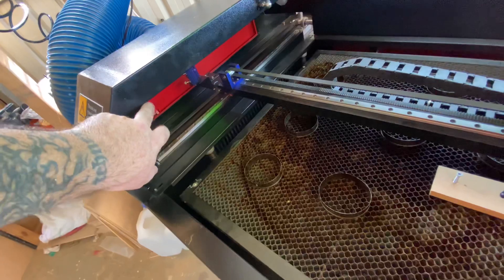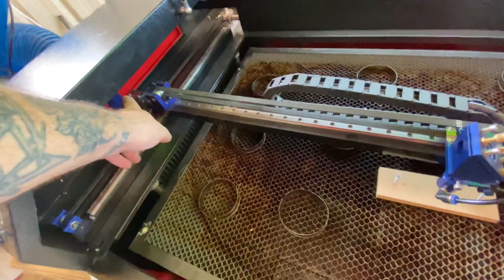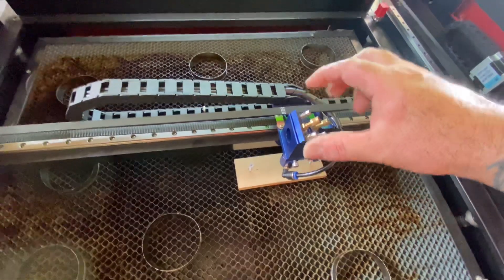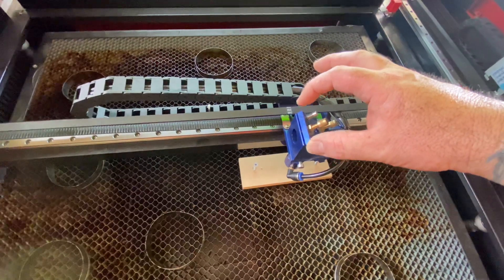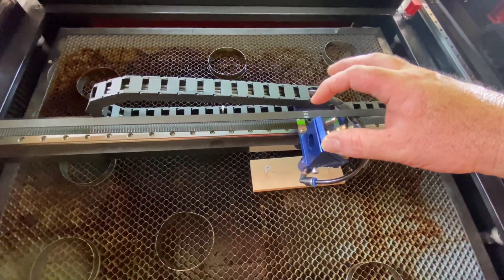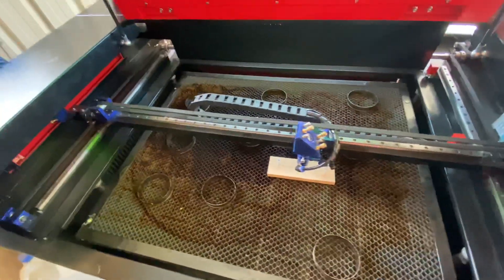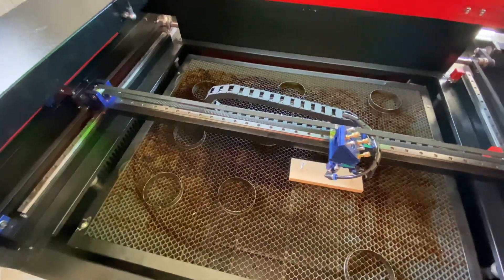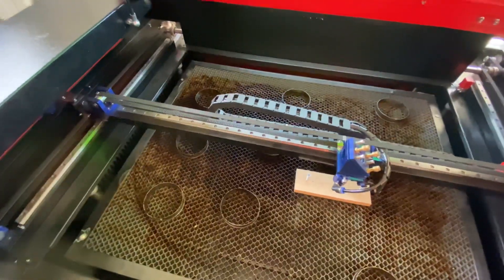It definitely helped putting the piece of paper in the front to locate that beam. And as I said, I did try adjusting mirror two, but it ended up being easier to just undo those four screws and move the laser head about two millimetres in — and everything then lined up beautifully. So anyway guys, thanks for checking out the video. I hope you liked it, and if you did, give it a like and consider subscribing. I enjoy doing these videos and I'll be throwing up more over the coming weeks. Cheers.